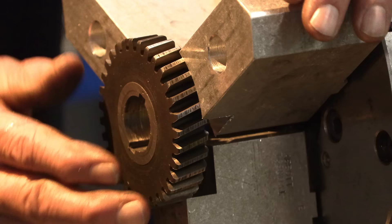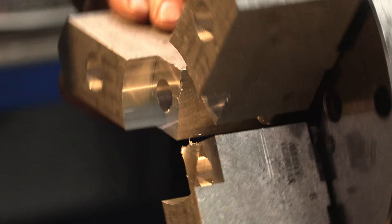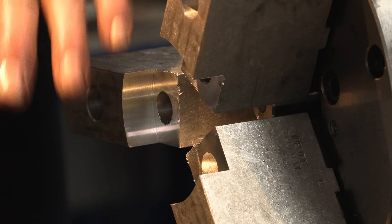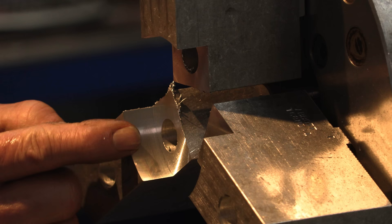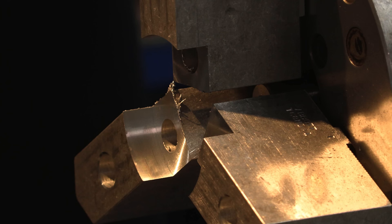I'm happy with that bore and the face. I'm going to come in and touch the face and then feed out to it. My readout is actually 3.422, so I'm about 22 thousandths over. By touching it and coming in and doing all that cutting, vibration, and letting everything settle in, it was pretty cool to be able to sneak up on it like that — that's how I wanted to do it. We're going to skim that and then lightly chamfer the outside right here, making sure that bore is more open than the gear so the stone can pass through.